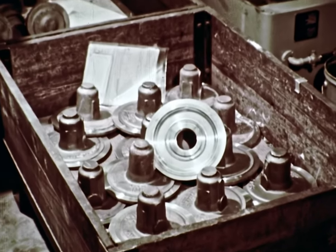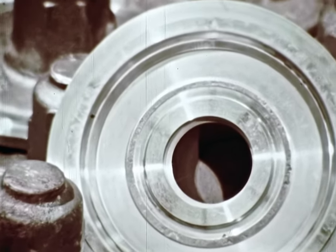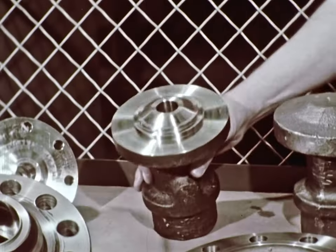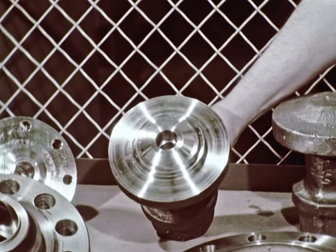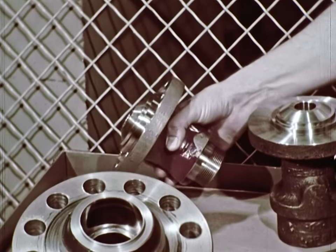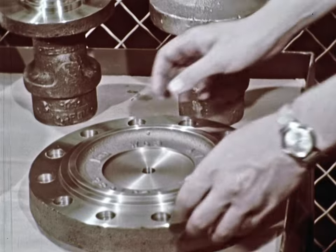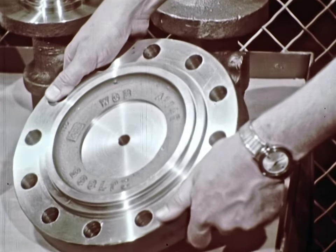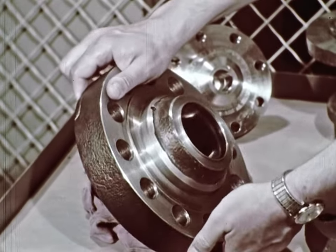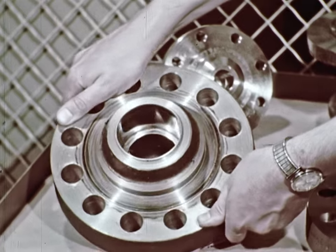The material in most of Fisher Governor's parts is tough to machine. Many jobs now programmed for the 220s were run on automatic turret lathes, but they were short to intermediate lot runs and the lengthy setup time with the automatics made their use prohibitive with 220s in the shop. These particular forgings are the general everyday garden variety — they don't have those hard-to-machine contours — but careful cost accounting on 220 NC chuckers clearly justifies the procurement for these parts alone. If Fisher Governor figures investment in two 220s would pay off for them, it should for you also.